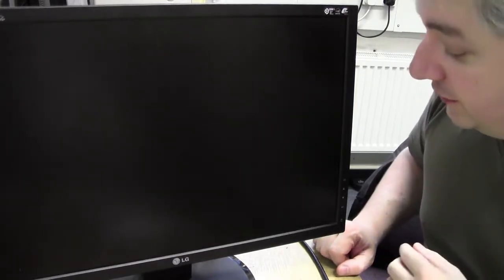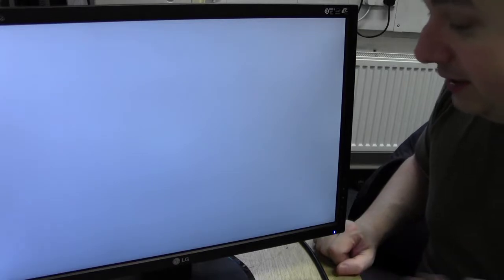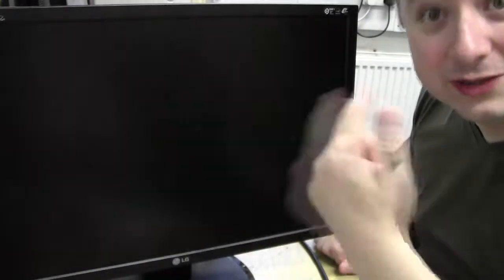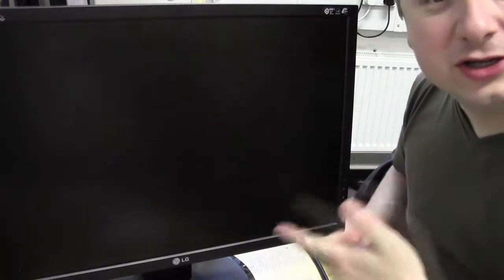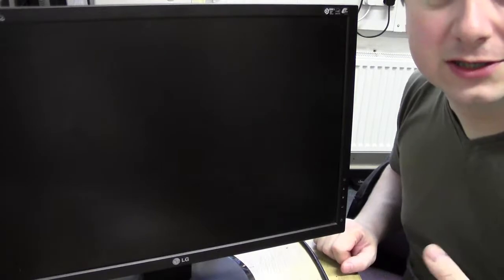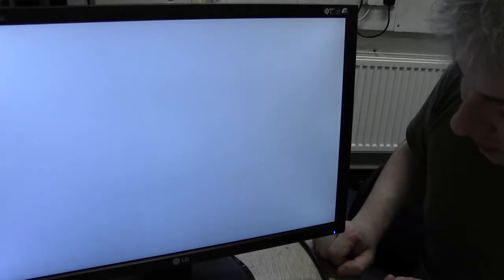Also, as it dries out, your values are going to shift as well. So as fast as they're charging, it's using that power that's actually stored there. Screen comes up, it uses power that's stored on the caps. They deplete almost instantaneously, and of course your screen goes down again. This is what's happening. So it's in this charge cycle. So I imagine it is the caps which are causing this. Okay, it's a timing issue on the supply side, on the switch mode supply.